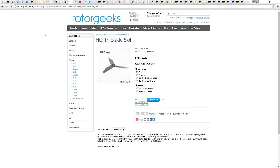As the motors I am using are high in KV, we are limited to 5-inch props. You might hear people talking about flying 6-inch props, which are better. This isn't always true, and a 6-inch prop with our high KV motors will burn it up. Higher KV will mean better agility. A lower KV motor might give you more power using a 6-inch prop, but at the compromise of its agility. A bigger prop takes more effort to turn, therefore it takes more effort to adjust to changes in attitude.